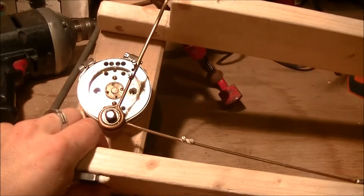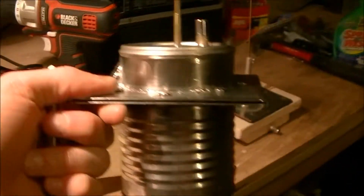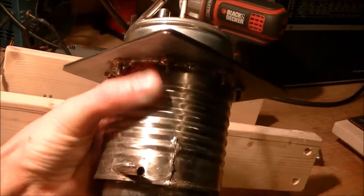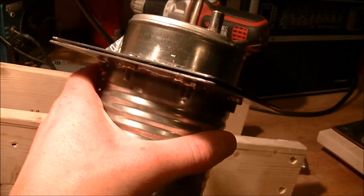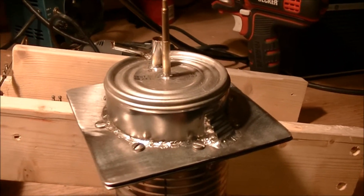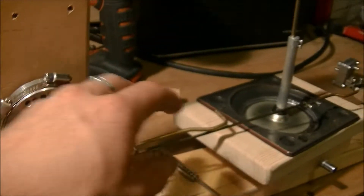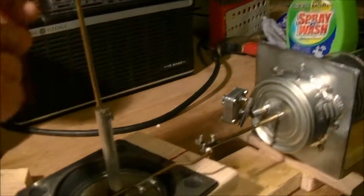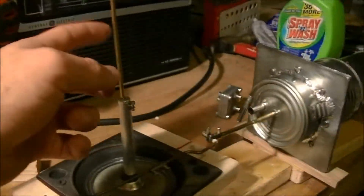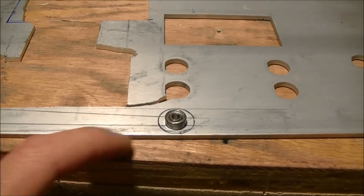So I'm probably going to go with the compact design. Let's get to work — I need to cut some wood and figure out how to connect the frame to the engine. My original plan was to clamp the wood around the water jacket, but I decided against that. I think I'll solder bracket pieces on instead. Here's the bar I'm going to cut out — it's all drawn up with the bearings marked. The small end at the top will connect to the flywheel, and the bottom connects to the diaphragm via the holes. It's made out of pretty thick aluminum so it should be plenty strong.